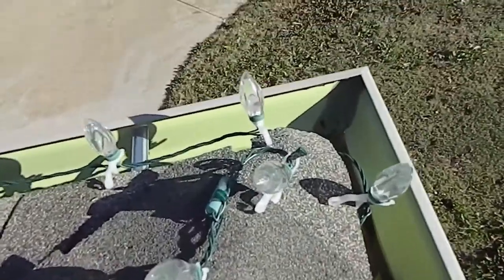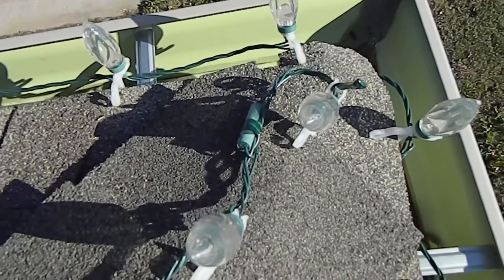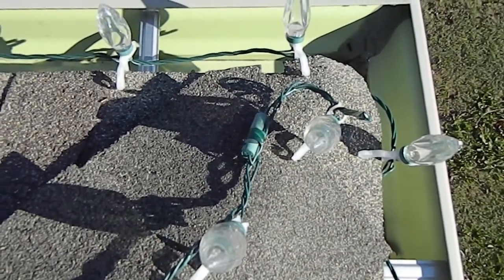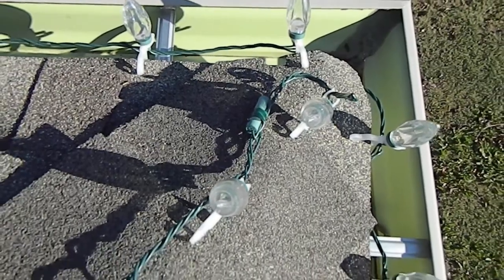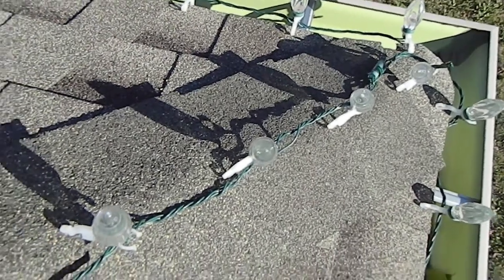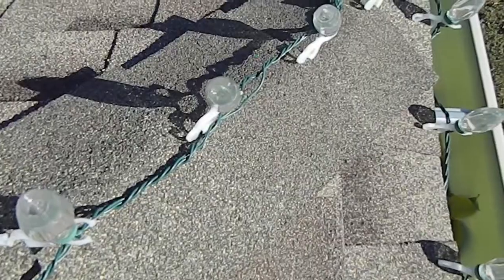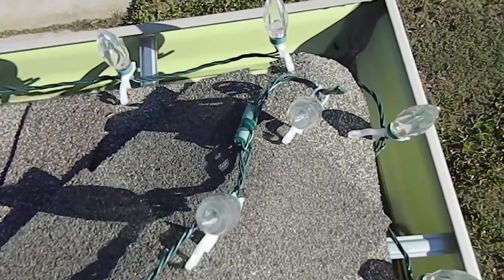This strand over here has 17 lights. You can see I moved the resistor accordingly — it's a 1.5 kilohm resistor running 20 milliamps through it, so it's dropping 30 volts. Now I'm not going to use fewer than 17 lights on a strand without changing this resistor, because now each light has to drop 5 volts instead of the 4.4 it was, and I'm getting close to the upper limit of what an LED can take.